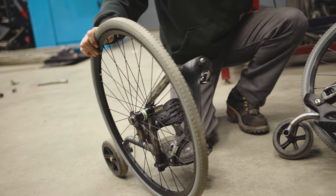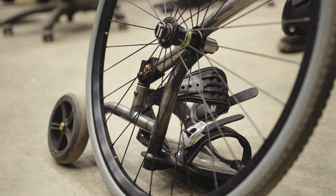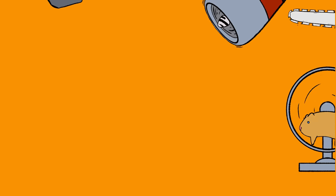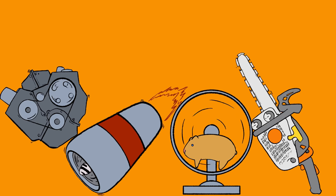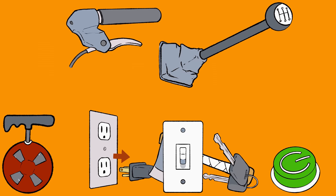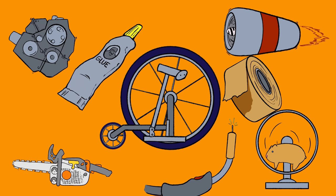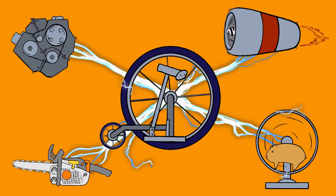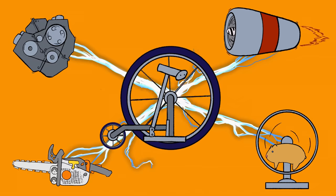These are looking wheel-y good — quite complicated to make. Can you believe this started from a wheelchair? Before I ride them, I want to do one more modification to guarantee these things will break some ankles — I'd like to add a motor. That sounds pretty easy, but actually no. We have a lot of problems: when the motor is attached to the wheels, how do we start it and then kill it? How do we control the speed? What orientation do we put the motor in — front, back, top, bottom? How do we mount the motor to the wheel and get it to turn the wheel? And how do we make sure it has enough power? We're going to need to design the gear ratio. These are all things I have to design for.